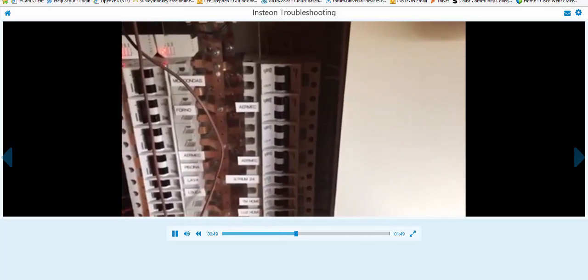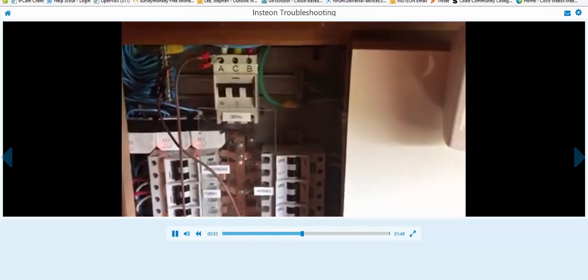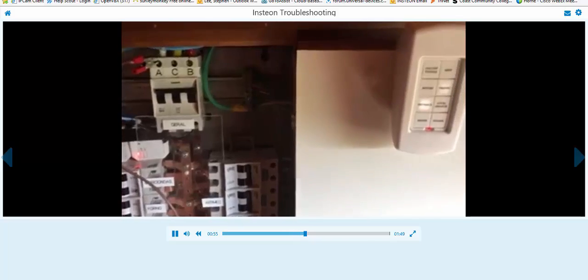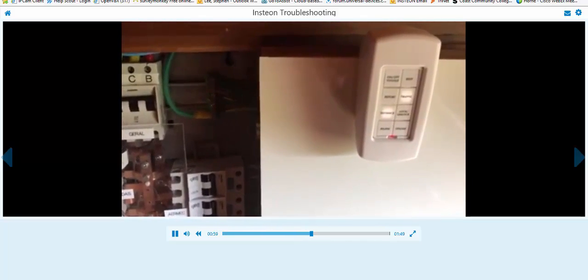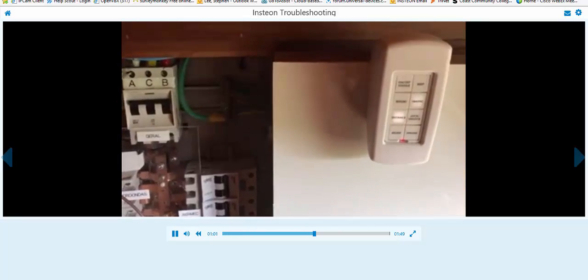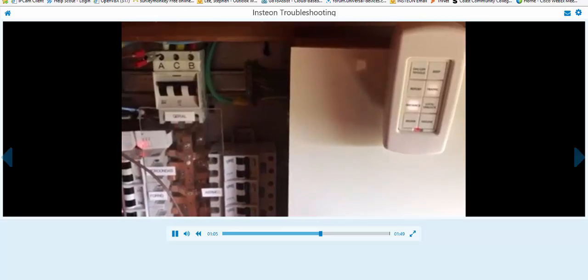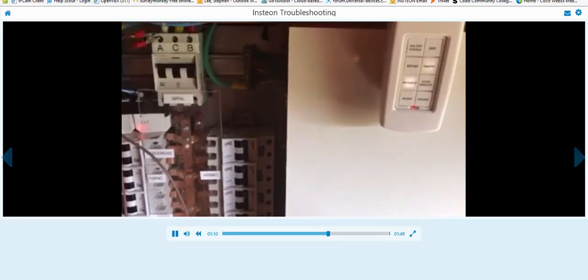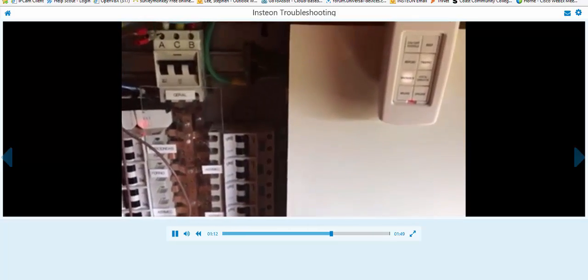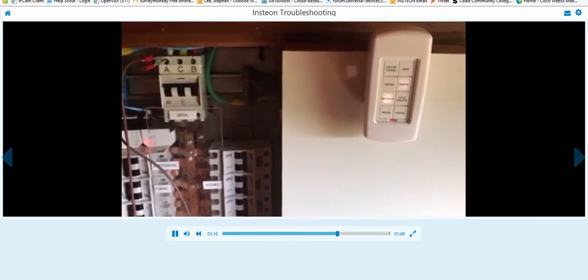Let's try this one. Looks like we're on to something — that made it better. There are no more error conditions and you can see that it's communicating pretty well. Sometimes when you turn off a load, it takes a little bit of time for whatever stored-up capacitor charge was in a driver to dissipate. But now you can see it's consistently communicating without issue.